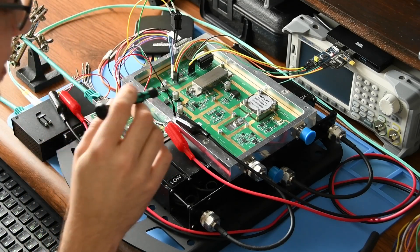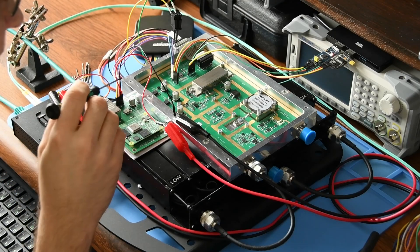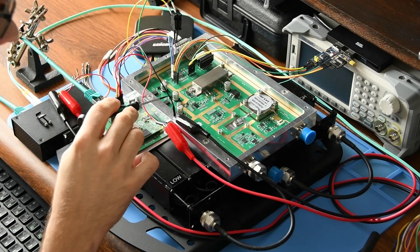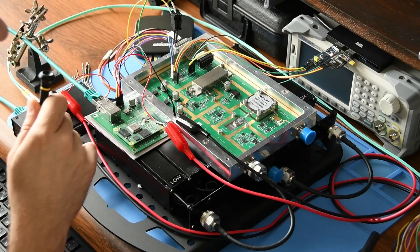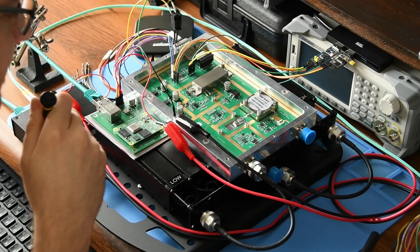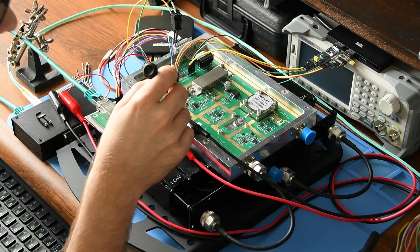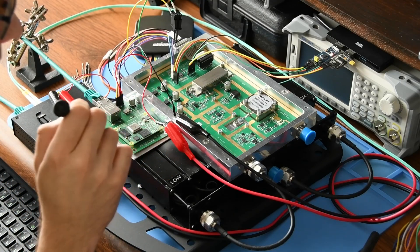In this revision we've got two CC1200 chips both clocked at 40 megahertz using this TCXO right here. There's a single TCXO, and after that generator we've got a NOT gate that generates a square wave. It takes a clipped sine input and outputs a square wave that's split into both CC1200 chips, so they are clocked from the same source.